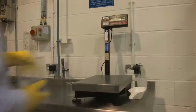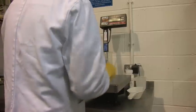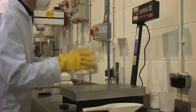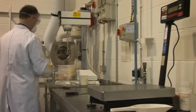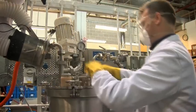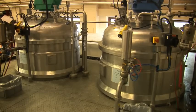Hi, my name is Helen Smith and I work for Unilever. I've been working here for just over two and a half years. I did my degree in chemical engineering and I now work in our process development department for the deodorant category. Our responsibility is to take a product from bench scale in a small 500ml beaker, scale it up to our pilot plant which is about 30 litres, and then take it up to a production scale which is a two to three ton vessel.